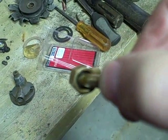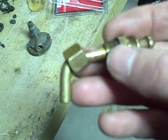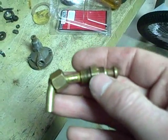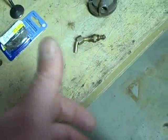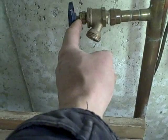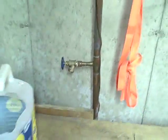It actually looks almost like a flat rubber gasket. I can't really get another rubber gasket or O-ring in there unless I was able to take this nut all the way off. So what I'm going to do is use a type of packing that comes in a cording that you wrap around the shaft and then slide the nut back in place. It's the same kind of packing they use for faucet valves in old faucets — like a spigot on the outside of your house still uses that kind of packing. Here's a boiler drain valve: you take that nut off and there's packing inside. If it was leaking along the shaft, you would loosen this nut, wrap this packing material around there, re-tighten the nut, and it should stop the leak.